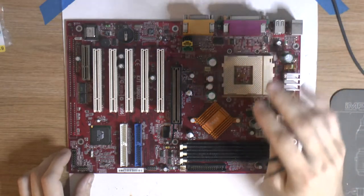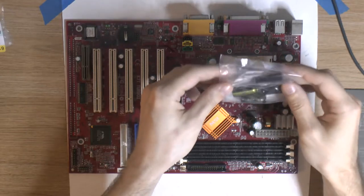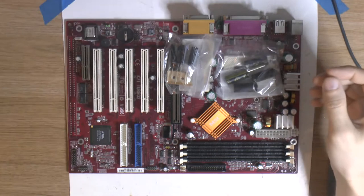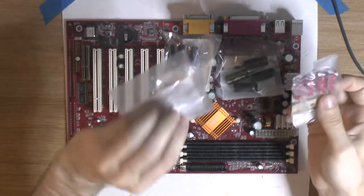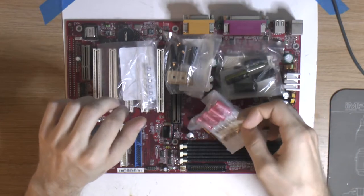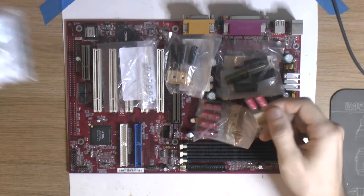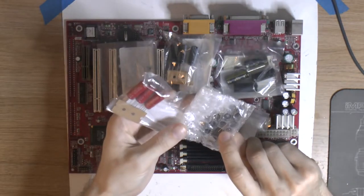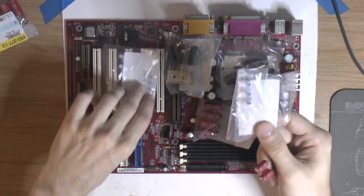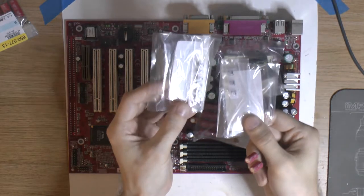And since I did another board, I already have bought caps since I had a cap list for this particular model. I bought some different caps here, they should be the right ones. Mostly Wima and German Wima and Philips, I think. I'm gonna throw them on it. Also got some of these SMD mounted ones. I'm gonna replace those too.